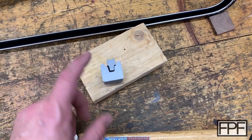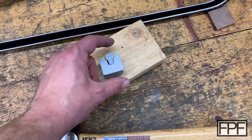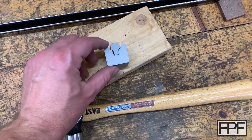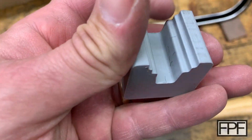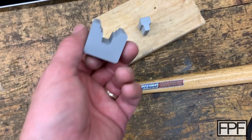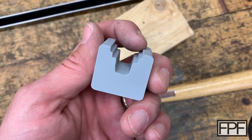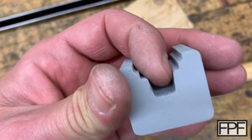Thanks for hanging out in the shop with me for another functional 3D print. I'm really happy with how this turned out. This held up really, really well. I started off pretty gentle, just using the clamp, and then by the end I was just using this like it was a steel forming die and just beating the crap out of it with a hammer — hitting it really hard — and with the exception of maybe one small little wave in the lower die, I don't see any deformation. That black stuff in there is felt pressed into place — that's just pieces of felt, not cracks. This held up really well for how hard I was hitting it. And this is not printed solid either — this is printed at 60% infill, which is plenty solid enough.